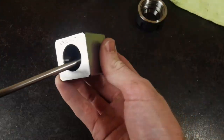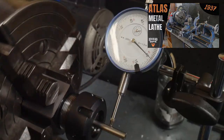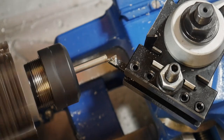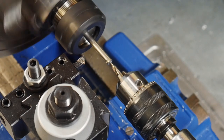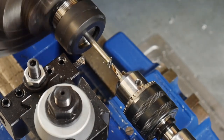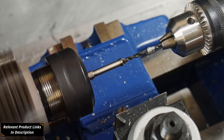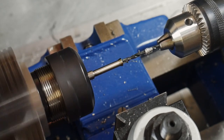As many of y'all who follow the channel will know, I recently restored a 1937 Atlas Craftsman lathe, and this finial will be one of the first projects I use it on. The four jaw chuck I have does not close enough to hold quarter inch stock, so this required me to purchase a different way to hold smaller stock. I landed on a cheap collet block — basically a block that accepts small collets in multiple different sizes — and for this application it worked pretty good.